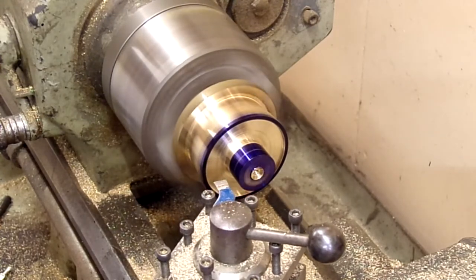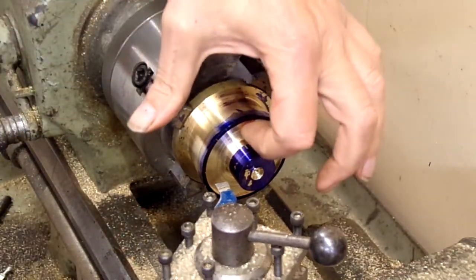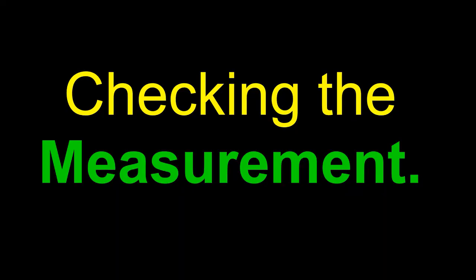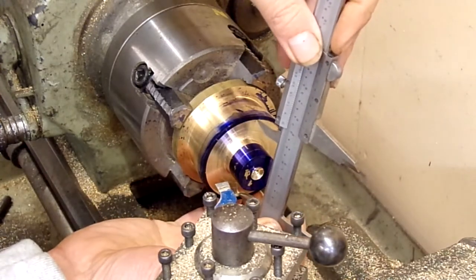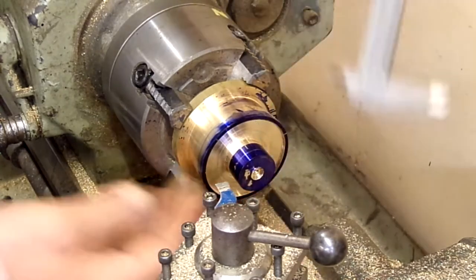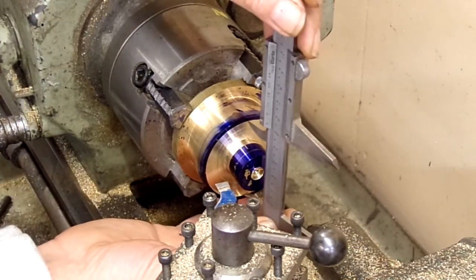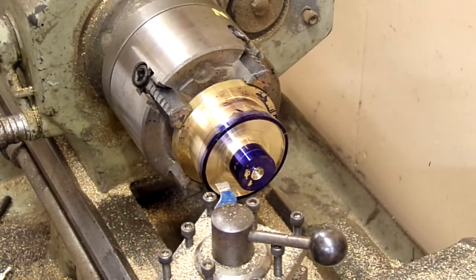There is the recess cut. That's exactly from the prop — I've just put the calipers across the prop bezel and there is hardly any movement at all. The prop bezel itself is 53.8mm. So we've got 0.2mm clearance, which is just about perfect.